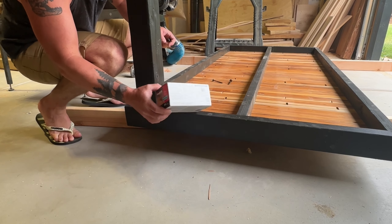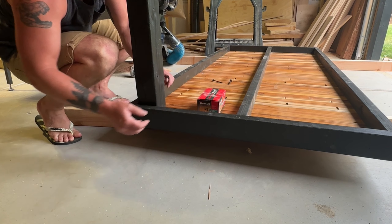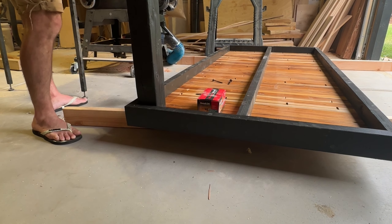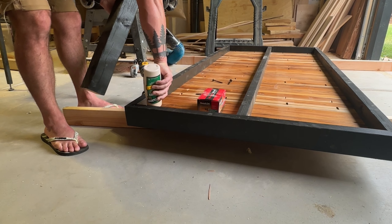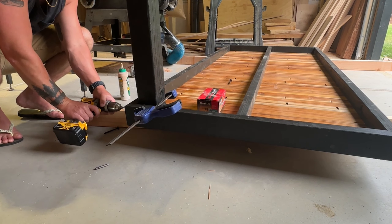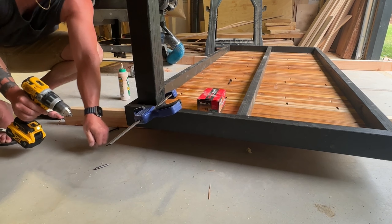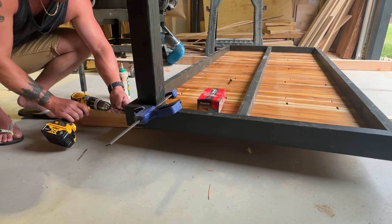For the last piece of this, I'm going to use these 3 and 7/8 inch lag screws — rated for decking and outdoors. Basically I'm going to put one here and one here on all of them, so two of these per leg. Using some wood glue as well, I'm going to slather wood glue all over here. You clamp the leg to the spot after you put the glue in, then use a small bit to drill a pilot hole. The pilot hole helps so there's less chance of it splitting on you. Then you screw it in.